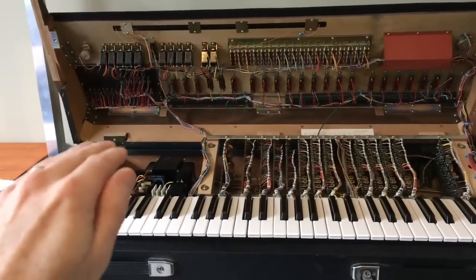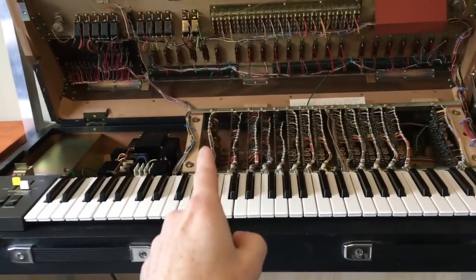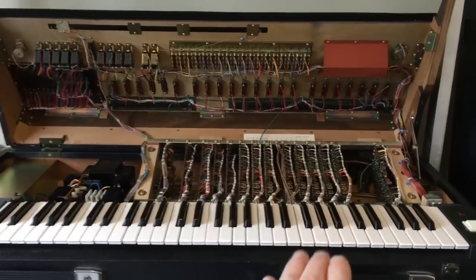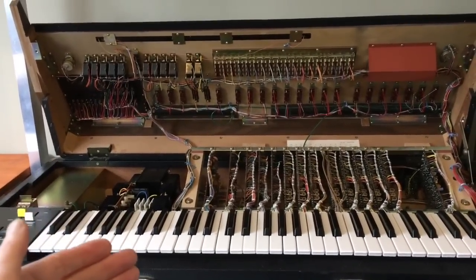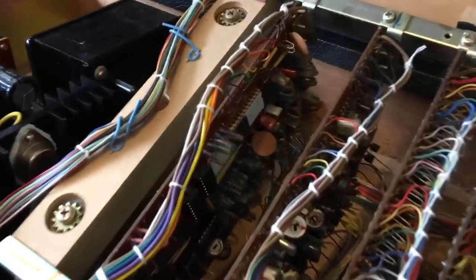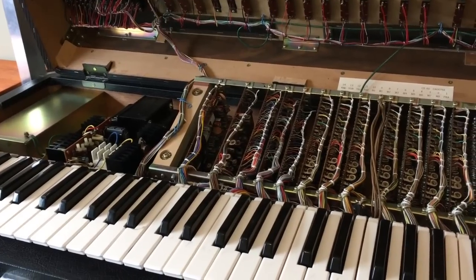I can't tell you how awesome it sounds to just open up the bass frequencies a little bit with a slightly higher filter frequency. You can't do that with any other synth besides the CS80. And that is all to do with that one circuit board - it has a lot of calculations to do. It needs to know which end of the keyboard each voice is on, how far into the slope, and then calculate the timing separately for each of the eight voices. There's so much to do, that's why there's an entirely separate board for it. And I've had a look in the CS50 service manual and that board isn't even there. That's a huge difference and explains why there's an entire separate digital-to-analog converter to control it.